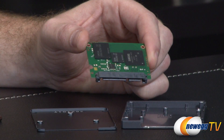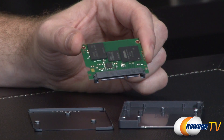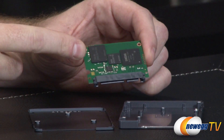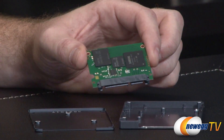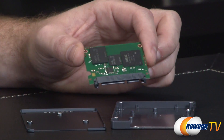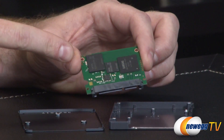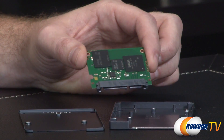The NAND packages are also made by Samsung — it's 19-nanometer TLC, or triple-level cell memory. A typical NAND is defined as either SLC, or single-level cell, which stores one bit per cell. For a while we've been seeing MLC, or multi-level cell memory, which uses two bits per cell. This is TLC, which is still technically multi-level cell, but triple-level cell — so you get three bits per cell.